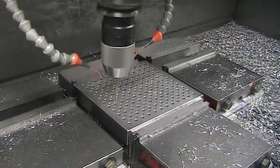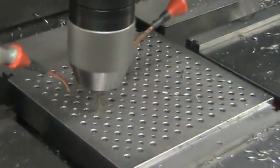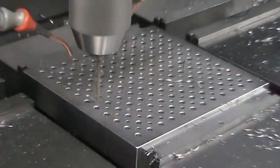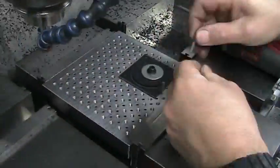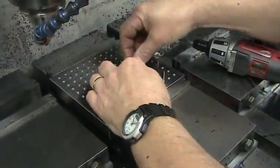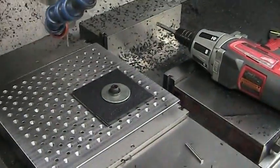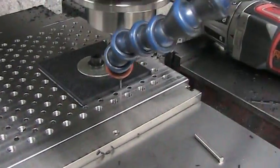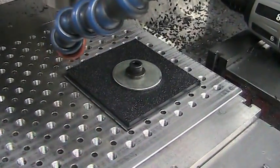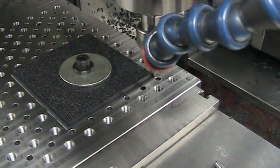Here I'm making a fixture plate with a grid pattern of tapped holes and dowel holes to be able to position the ABS plates in different locations and use different clamps. There's a sacrificial plate on the bottom to keep the end mill protected from going down into the steel. The dowel pins located it to make sure we have a consistent amount of material to remove on each side. I'm doing the periphery with an O-flute cutter — a single lip cutter specifically designed for cutting ABS.